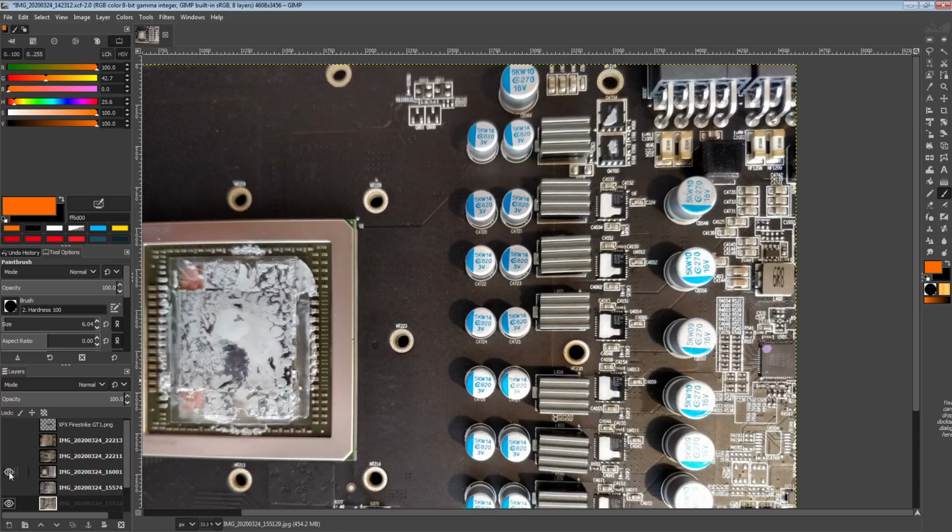So yeah, that's the reason why most cards will generally, and actually even NVIDIA reference cards these days do it as well. Or actually, lots of NVIDIA reference cards do it, where they have a bunch of SMD capacitors and multi-layer ceramics and a rather impressive configuration of capacitors on the output. And the first thing the board partners do is just get rid of all of that and replace them with a bunch of through holes, and then it's good enough right there.